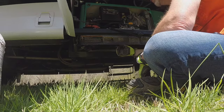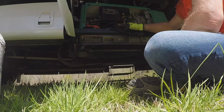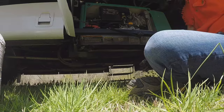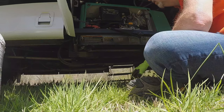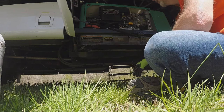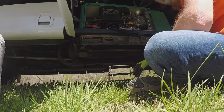Before we loosen up the oil filter, you're going to want to drain it. One thing I like about this unit — which is on a 2017 Newmar Canyon Star 3921, though it doesn't really matter what RV you have as long as you have the same generator — is that it has an actual little toggle that you just toggle and it will drain the oil. It has a toggle and a little spout that drains the oil, making it very easy to change. We'll go get a pan and start draining, then take out the filter.